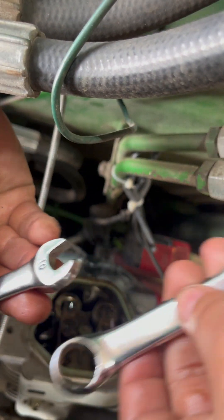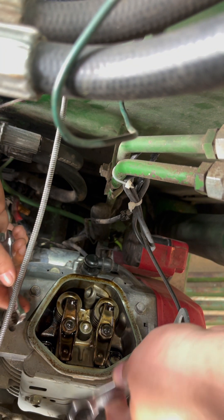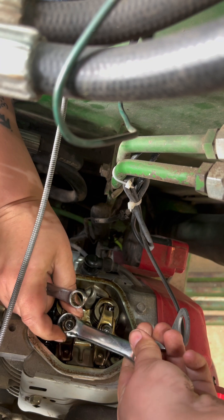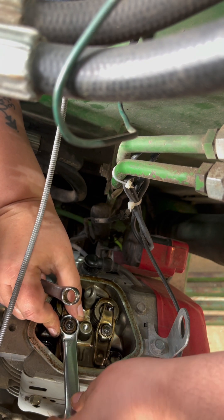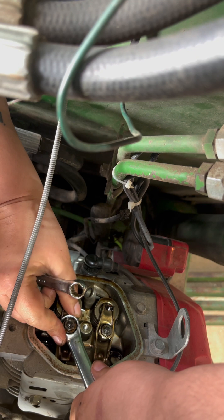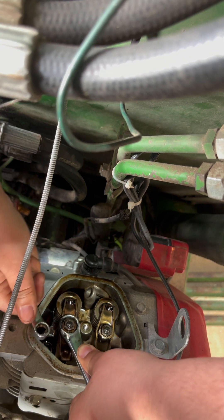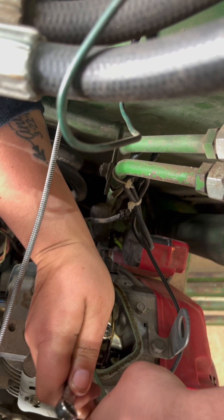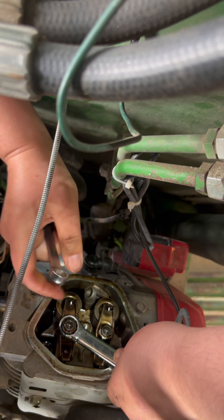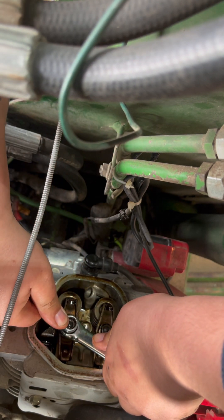I have a 10 millimeter and a 14 millimeter. We're going to loosen this back nut just a little bit — not much, because you don't want to make too many adjustments because then it's going to throw your whole machine off. Just loosen it just enough so I can loosen this nut, and that's where the 10 millimeter goes. For this one, just a little bit more because I can't make any adjustments.